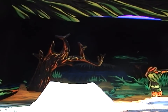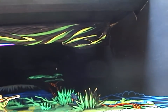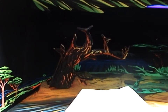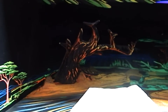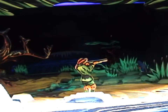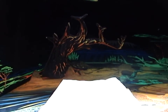Looking back down inside the game, we can see the play field. There's normally a mirror which goes across here, so when you're looking you're actually seeing a view back down inside the game. I believe one of the earliest games this was a technique used — rather than making the game six feet wide and six feet deep, you build your play field back down into the base of the game. It gives the player an illusion of depth — it looks like you're actually seeing targets quite a few feet away, looking back down inside the cabinet.